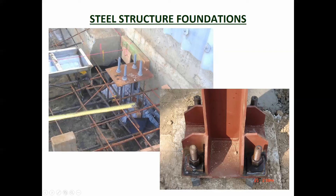When they cast the concrete, they will remove that temporary plate, and then they'll put the actual column and base plate on top. That plate is just to hold everything in place so it's nice and level, and to make sure that the concrete doesn't go above where the steel plate needs to go — giving a nice level surface. Here you can see the column with the steel plates welded onto it.